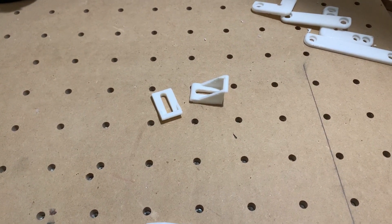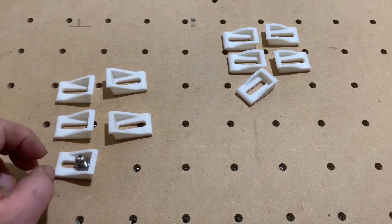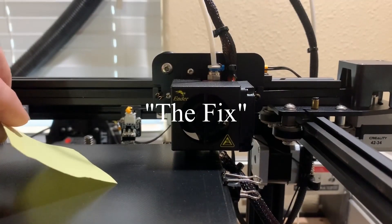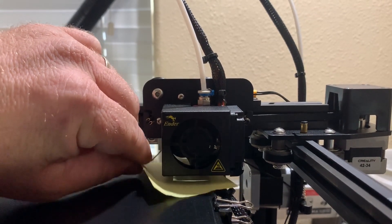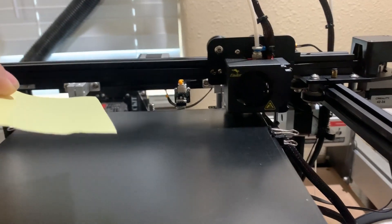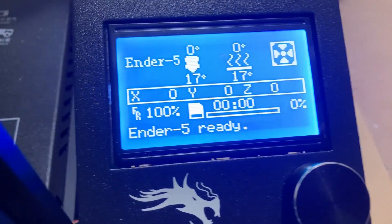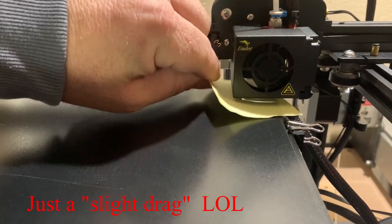They do have some other sizes — the one inch and the one-eighth. For bed leveling, the key is to go around all four corners and put the paper between the nozzle and the bed until you feel a slight drag. Slight drag is exactly where you want to be. Do that on all four corners, about three different times to get it dialed in. Then come back to the middle and do the same thing. That will be your Z zero — you can hear a slight drag, and you want that same drag all the way around.